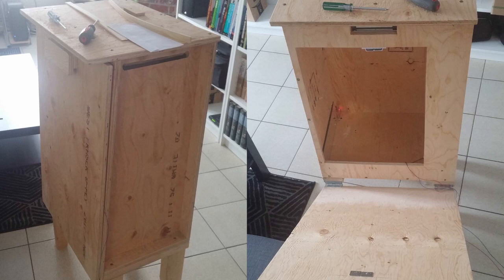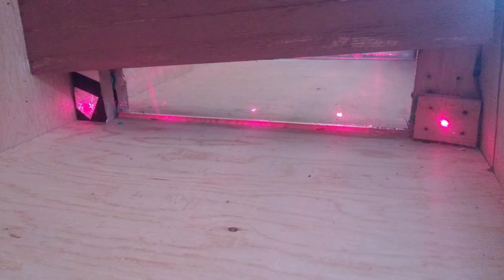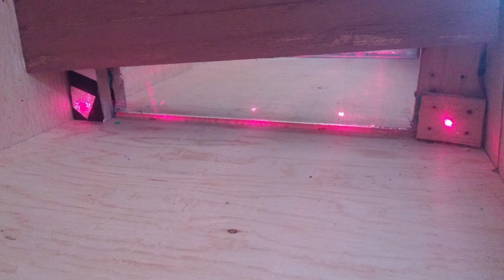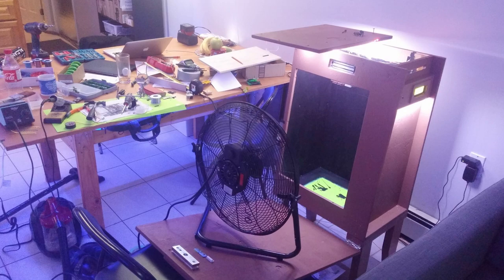Thanks to my friend Albert's help, making the box was quick and easy. Getting the electronics working was trickier, especially the mechanism for deposit detection, for which I chose to use a light barrier. Aligning the laser diode to hit the photoresistor after bouncing between the walls a few times proved a futile attempt — it was simply not possible due to the constantly warping wood. In the end, I decided to go with multiple diodes and photocells to shoot straight across.